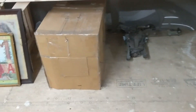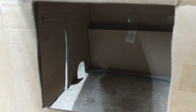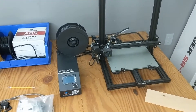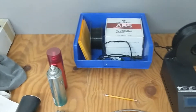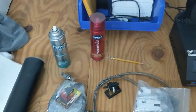This is my old enclosure — it's made of cardboard, actually the box that the printer came in. I hacked it up, taped it together, and cut a slot for the wire to go through with a little notch for the cables. This has worked well in the summer months, but when it's cooler out, it won't hold the heat in as well. The ABS will start to warp and peel off the bed. It doesn't even matter if I use really strong hairspray to try to hold it down — it just peels off.